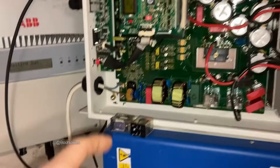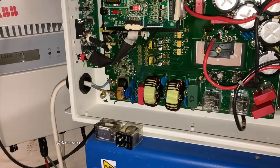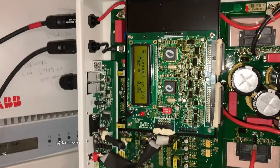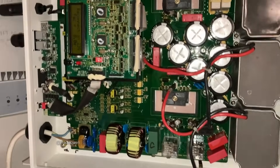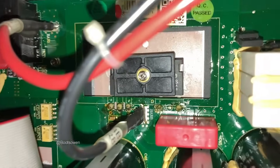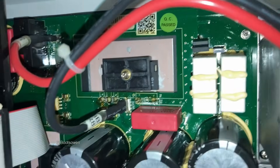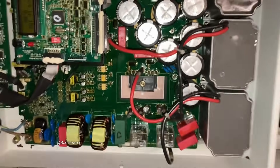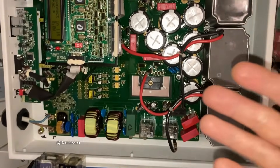Or don't close it up again carelessly — if you touch that terminal there you'll get a shock because it's 240 volts AC. The other thing I did was put a bit of heat transfer compound underneath the FETs — you can see some of it sticking out — because what was there was very dry, and I thought that could only help.